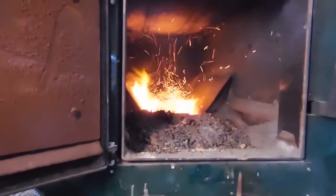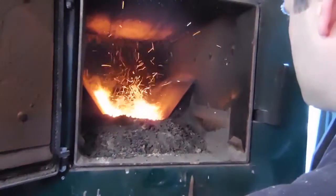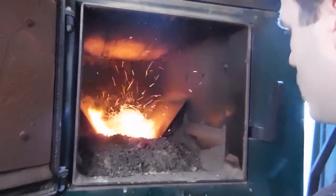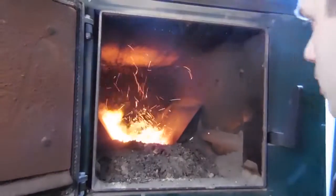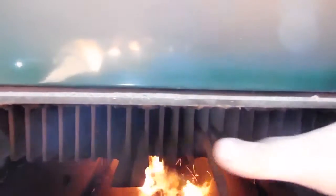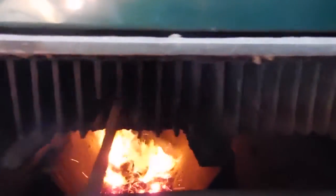This grate's been in a long time — I've been running it now for two years and it's not warped at all. Are those replaceable? Yes. It lifts the whole thing right out and you put a new one in. I've had thermometers in here reading 1,300 degrees right at this point, and 350 at the chimney. So that can extract at least 1,000 degrees off just that alone.